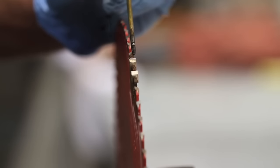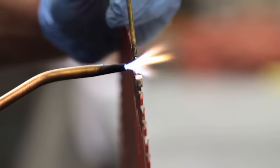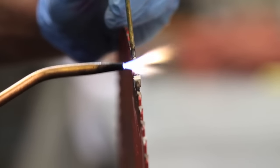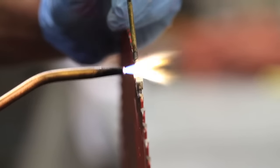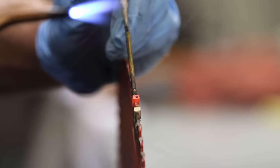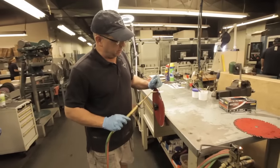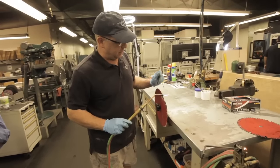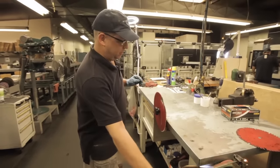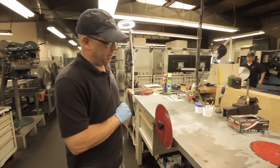I'll try to put just a little bit of pressure on here to hold it in place. What we want to do is get the tip to just reach a little bit of an amber color. I'll let that one cool off. Around there, it burns the flux off a little bit and the shim is melted down. And once that cools off, the tip's not going to come back out of there.